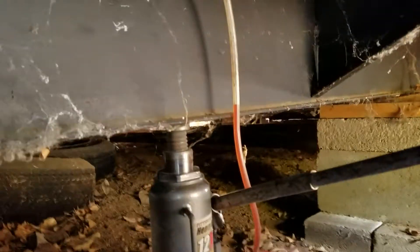We're just going through getting all high beams level with the high point using the water leveler. We just find the high point with the water leveler and then get everything level with it throughout.